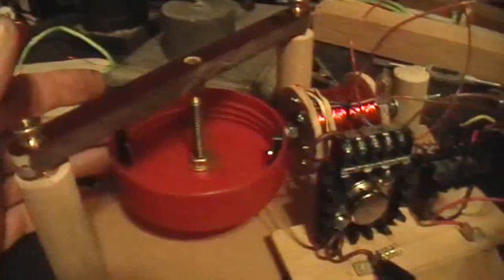The schematic is exactly the same schematic as Bedini's North Pole motor, because that's what this is — it's a North Pole motor. I have a little 12 volt battery here. I've got 800 turns of wire on the coil, so I have a little bit more resistance than Bedini's 450 turn motor. Now let's see which wires I'm using — this one for plus, and this one for minus. Usually when I hook it up there's a little flash of the neon. It did flash but I don't think the camera caught it. So we're hooked up now to the battery. You have to give the thing a pretty decent spin to get it started.